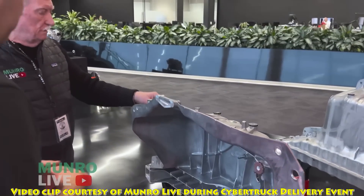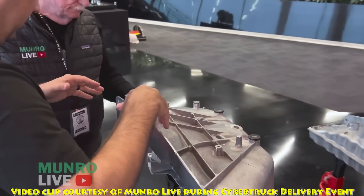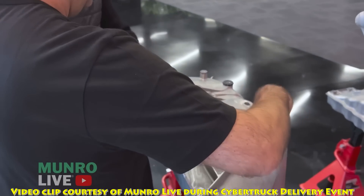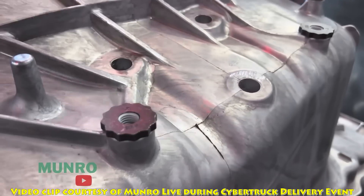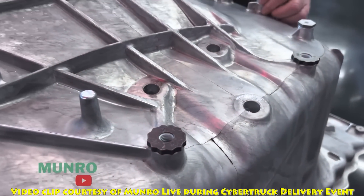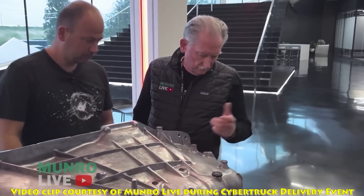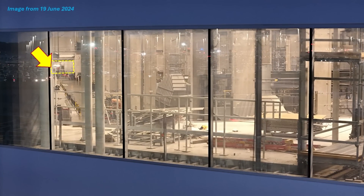What's cool about these inserts on the Cybertruck is that they're actually tapered because they didn't want to machine them. So there's no machining for the holes or anything — you just twist them in, self-tapping and tapered. There are external ones for the bigger connections and internal ones for the smaller ones. Some of them are self-tapping screws. These machines make sure that a lot of the hard connecting points for bolts and other fasteners are placed onto the castings before they head off to the assembly process.